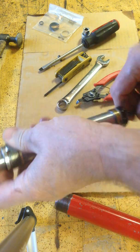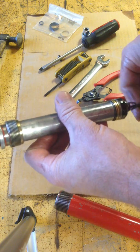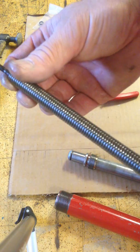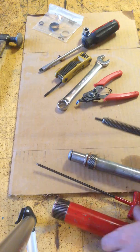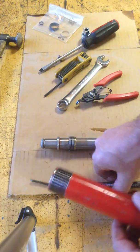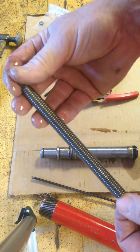I'm going to remove that so you can see what that looks like. Here it is out — there's a screw on the end there. That screw can come dislodged, and if you take the fitting off the end so there's no air pressure and you start pulling the ram out, then you've probably got either a dislodged or a broken spring. These springs can break if the tool gets twisted inside, and that's one issue.